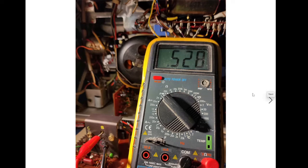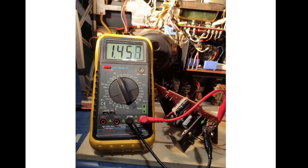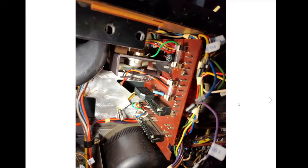It tested okay. We can see the voltage drop here — I measured the potentiometer to see where it was before, so when I put the new one I will set it at about the same resistance. This was 2.5 kilohms but the new one is 2.2 kilohms, as 2.5 kilohms doesn't exist anymore.